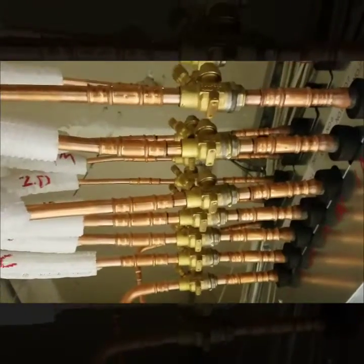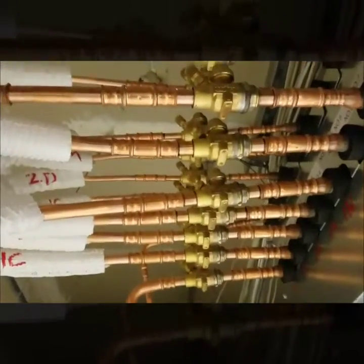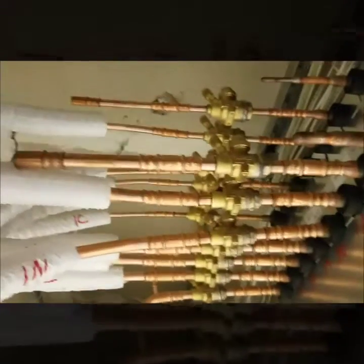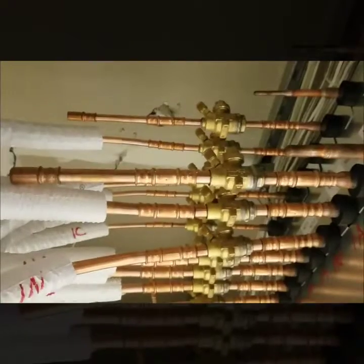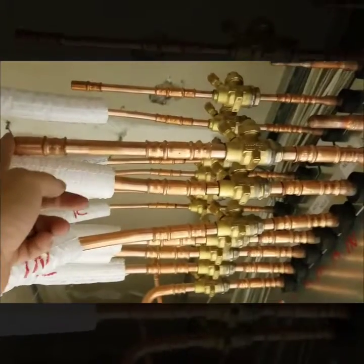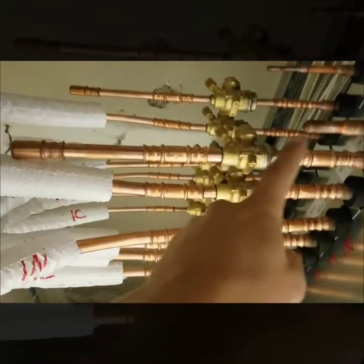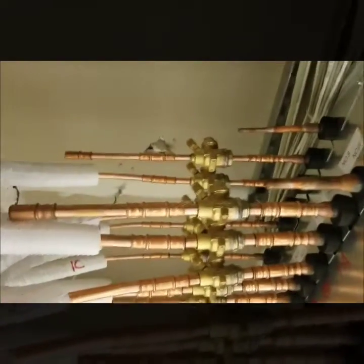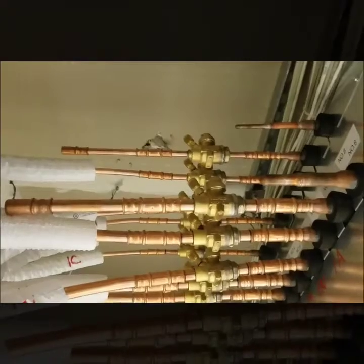You can see we added the valve for the seventh port — if we ever want to add an additional indoor unit, we're able to just add a little chunk of pipe and put the cap right on. So if we do want to add, we can just valve off, make a cut, and add our next run. This really makes it simple for any additional systems we might add in the future, so we're just prepping ourselves for future work.